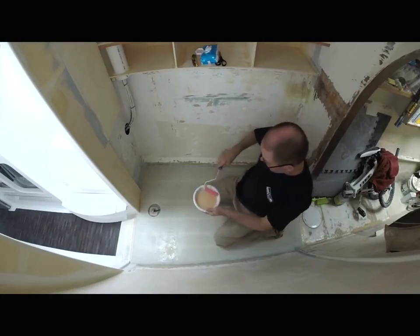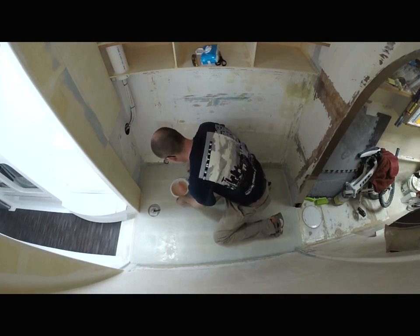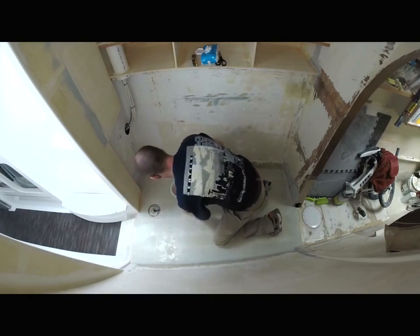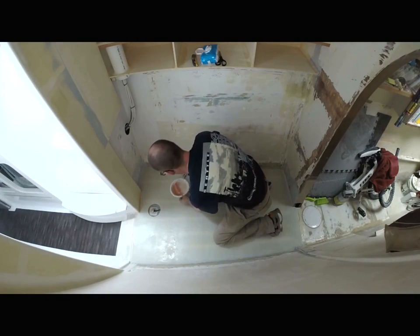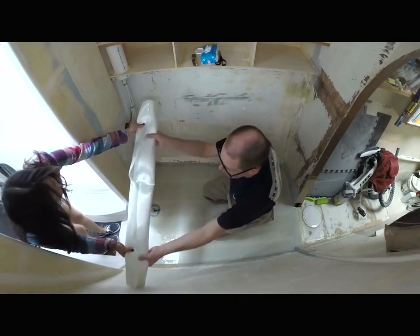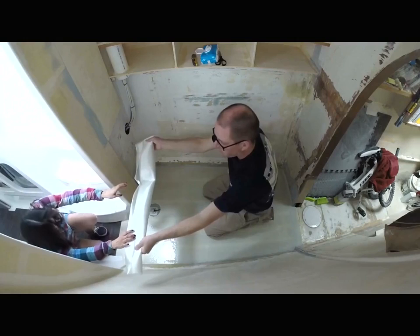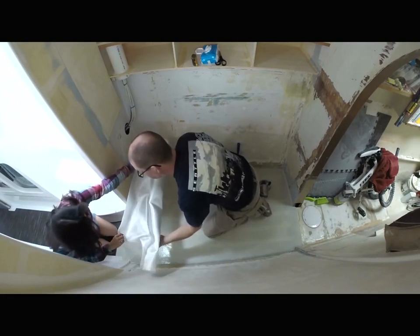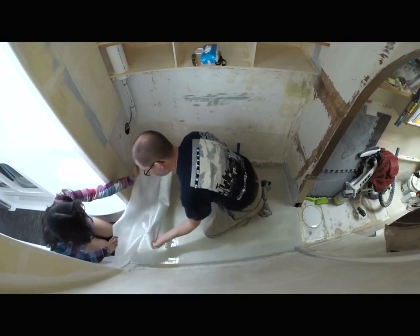So after the tank was secured, we shaped in a 3/4 sheet of honeycomb composite to fit the floor. It was epoxied to the hull, and glass cloth was layered for strength. The hardest part about this whole project was making sure that when I laid the floor down, it planed out with the floor on either side. But everything went as planned, and I'm happy with the outcome.